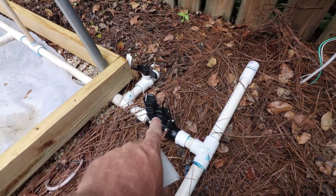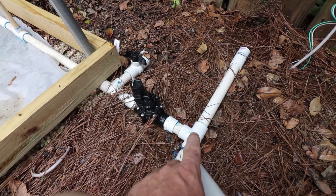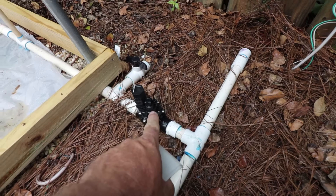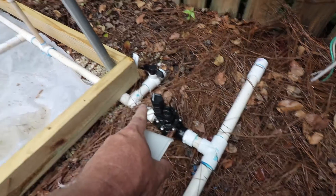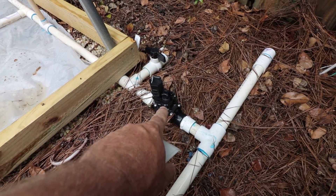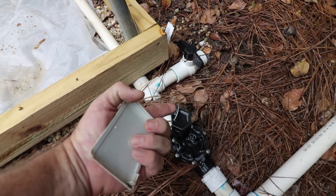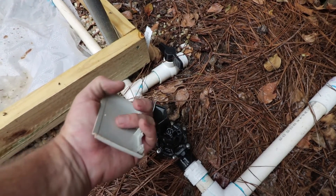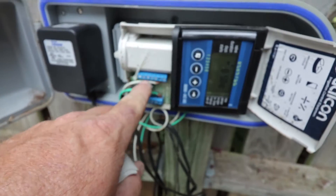It is connected to an electric valve here and then connected to my water line. You can connect this to a faucet, but I don't think you'll be able to run very many irrigation heads, which is fine — you'll still be able to run the system no problem. But you need an electric gate basically, is what this amounts to. This electric valve is just a gate between the water supply and it getting to these mister heads. That clock will have it come on every six minutes or so and it'll run for three, five, or six seconds or whatever we're needing. It's got two wires on it — one runs back to what's called a common, and if you had multiple valves they all run together on the common. The other one is for the individual valve itself. Those wires run back to the clock right here.